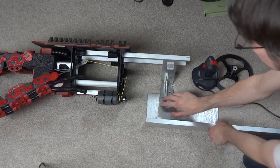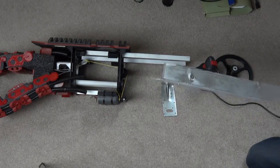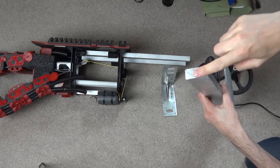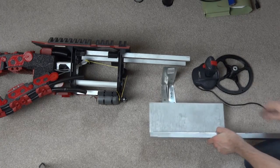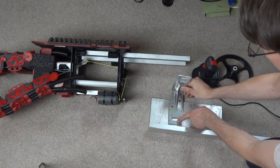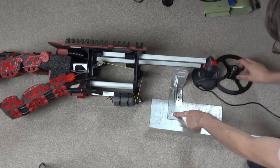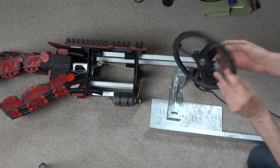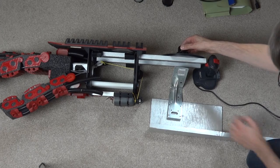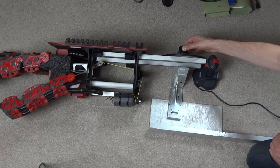Here are several parts. I've got a piece of plywood attached to another piece of wood, which has been painted silver to match the rest of the frame — that's going to form the main stick for the arm. The other end is going to be attached onto the studding I just showed you. I've got a metal bracket there, the kind used for building timber-framed houses, which is going to form a hinge to the forearm. So I've got this 3D printed part with two bearings in, which is going to screw onto the forearm. A piece of studding will go through, bolted onto this bracket, allowing this piece to pivot so the whole forearm can pivot around the elbow joint.